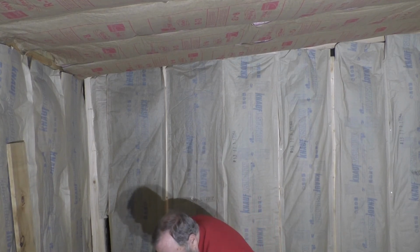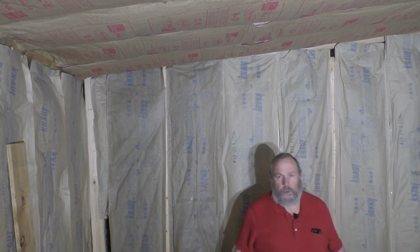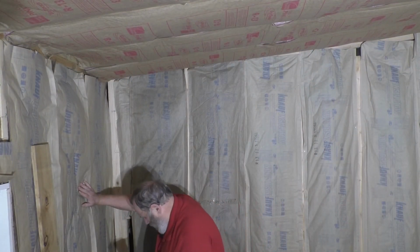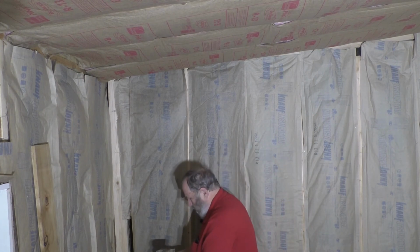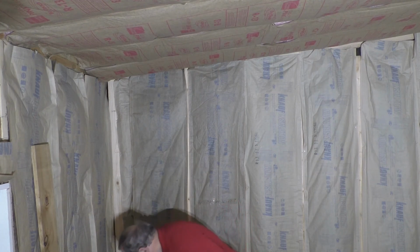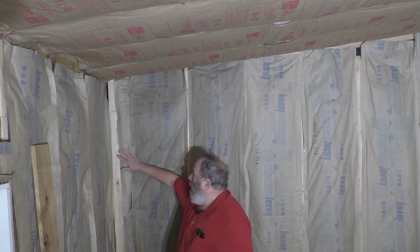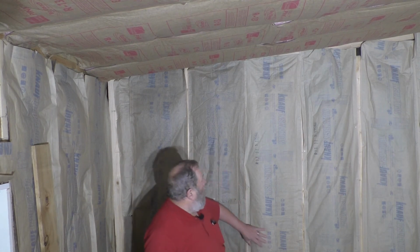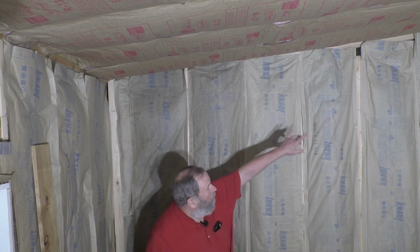We still have some room at the bottom there we need to fill in. And let me dig through the scrap pile and see if I can find something that might work. As it happens, I found a piece. Stick it in there. So again, like this top piece, bottom piece is stapled to the stud, goes in behind the panel that's already there, the large panel. And tomorrow I'll go to the store and grab some tape, and we'll tape this up along with the joints between the two pieces, the patches, and that'll do the job. That's good enough for tonight.